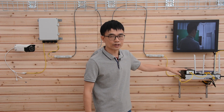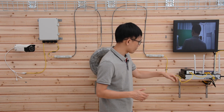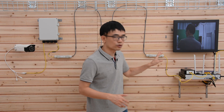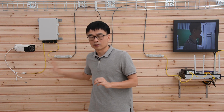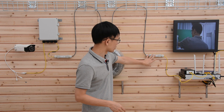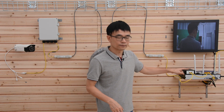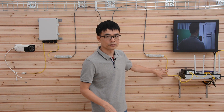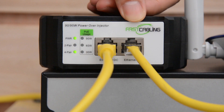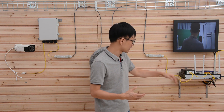Now let's move to the router. We also need this PoE injector. The PoE injector will add power to the Cat5e Ethernet cable so these two PoE extenders can get power. These are electronic devices that need power, and we don't need a separate power source at each PoE extender — the power is sent through the PoE injector via this Ethernet cable. We have connected the data port to the router, so you get both power and data through this one cable.